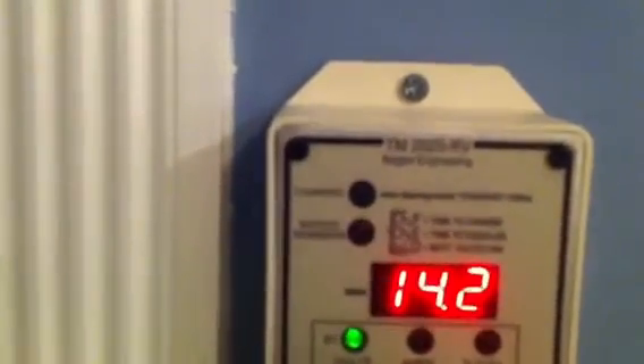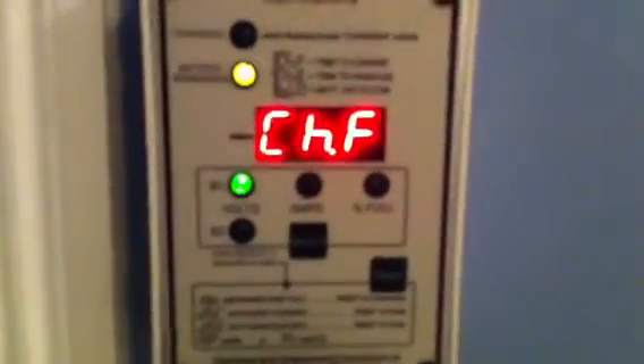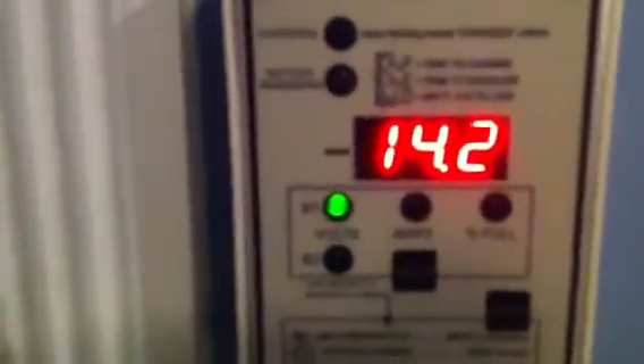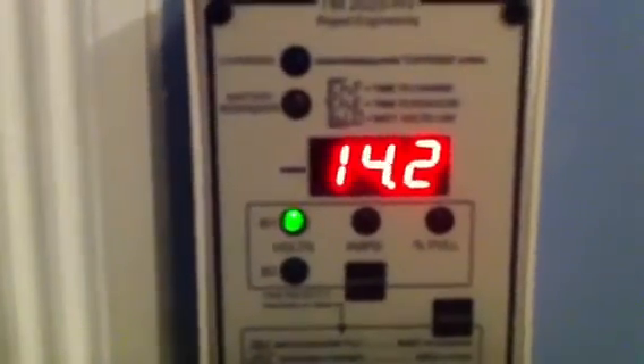Then we go to B1, and that's showing my battery voltage right now — I'm at 14.2 volts, so it's almost fully topped off. That'll reset very soon, and it does it automatically. As soon as it knows they're fully 100%, that blinking CHF charge reminder will be gone.